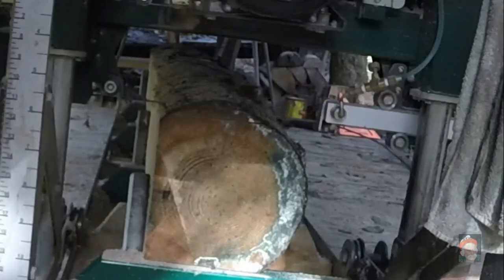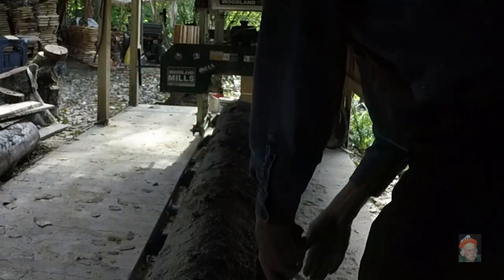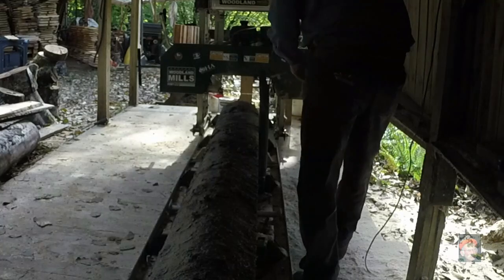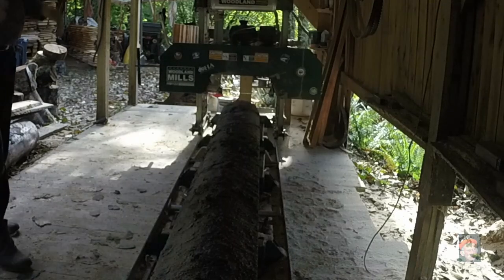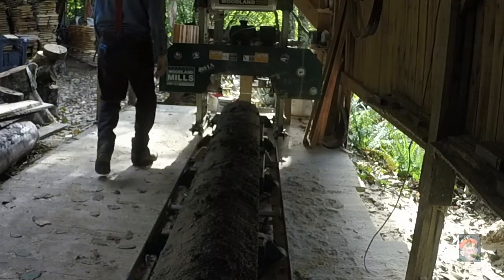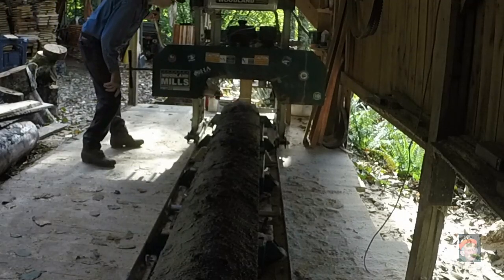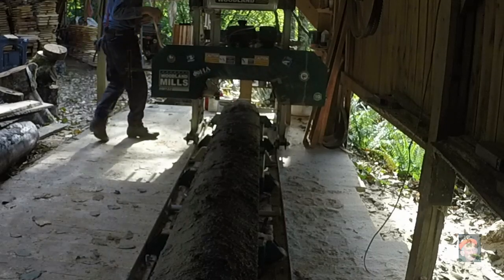I crank back down to the same hole where I started the previous cut, and the blade enters the kerf perfectly. And this is a matter of going down by 3/4 until I get a cant. The 3/4 inch siding I need can be random width, so I'll just slice down by 3/4 and resaw the thin slabs to get my boards.